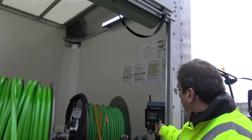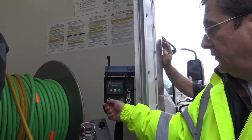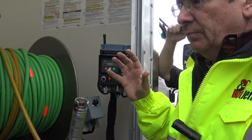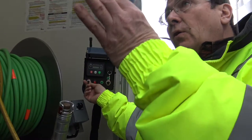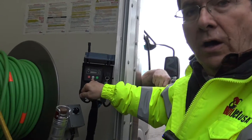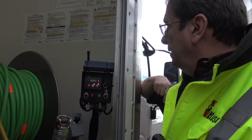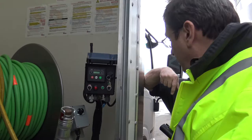You've got a light switch right here. You've got an override switch that'll override the low water shutoff right here. So if you want to override the low water shutoff and you're going to antifreeze the tank as well — now this unit's got a heater, but that doesn't mean if it's really, really cold you're not going to have to antifreeze this system. So if you need to override the low water shutoff, that's a defeat switch there. If you want to use remote control, that's the auto. If you want to manually start, it's green. Off is right here. So we're going to turn the key on — it's Deepsea Electronics, best remote control there is. We'll use remote control.